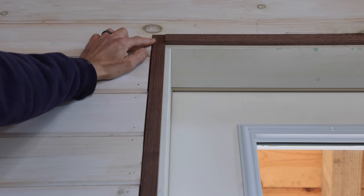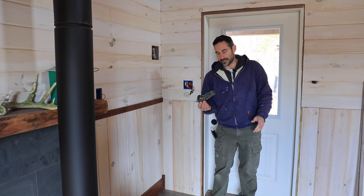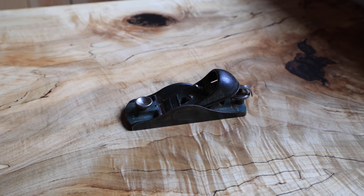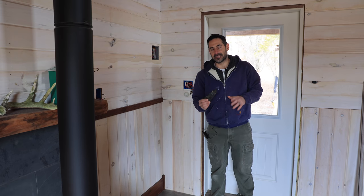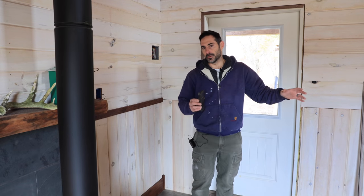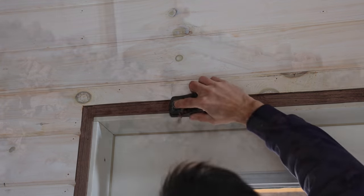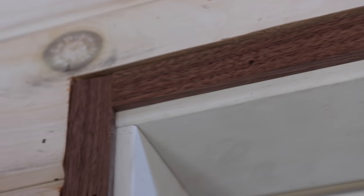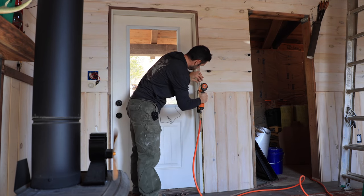This piece is a quarter inch or so thicker than this, but luckily we have a great tool to deal with that - the block plane. This is an awesome tool, and the good news is that so many of these were made that they can just be found easily. This was a ten dollar marketplace find - it works perfect, it's old and solid, well-built. There's no excuse not to find one of these. I'll just keep nail-setting these screws until it's flush. We got this pretty much all planed out - it wasn't fun but it worked.